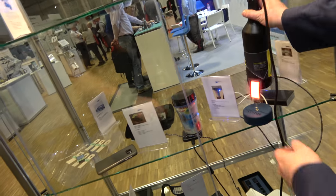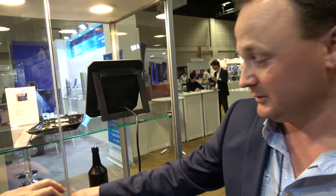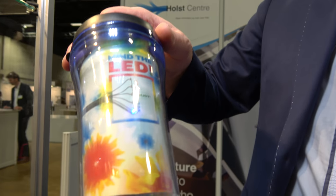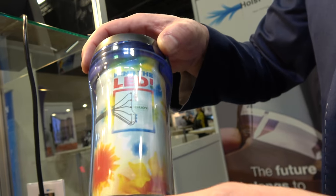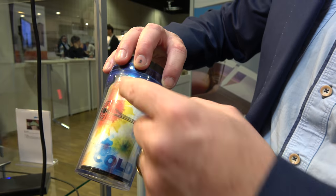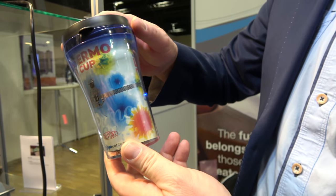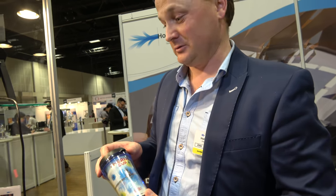What do you have here with this cup? That is for demonstrating inkjet printing. Most of the things here are made by screen printing, but this is made by inkjet printing. We have printed circuitry, and this cup measures the temperature of the liquid inside. There's circuitry and LEDs, a battery in the back of the graphics, and wireless charging. It's a nice demo — just to illustrate that inkjet printing can be suitable for making multilayer printed circuits.